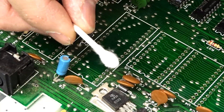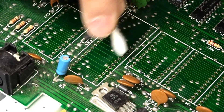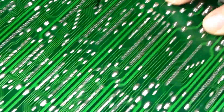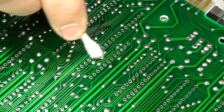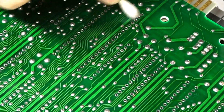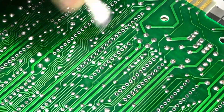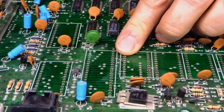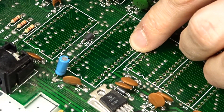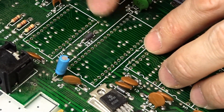Next I take one of these cotton swabs, apply a little bit of 91% isopropyl alcohol, and we're just going to clean this up. Nothing much is on this side of the board — all the extra flux was on the back side. We can also take the Sharpie X off while we're at it. So this 40-pin DIP came out with very little drama. For me, the trick is hot air — it releases those few stuck pins without forcing it and without lifting the traces.